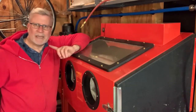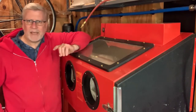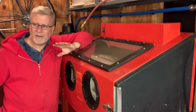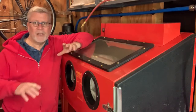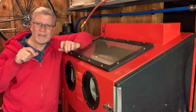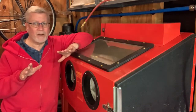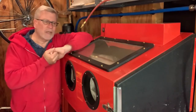I always try to cover any machined surfaces or delicate parts. The blasting cabinet isn't good for taking dirt or grease off things — it has to be something brittle like rust or paint. You can use that to your advantage: if a part has an old decal you want to save, tape over it with masking tape trimmed close, and you can blast right up to it. It won't take the tape off, so that's a handy little trick.